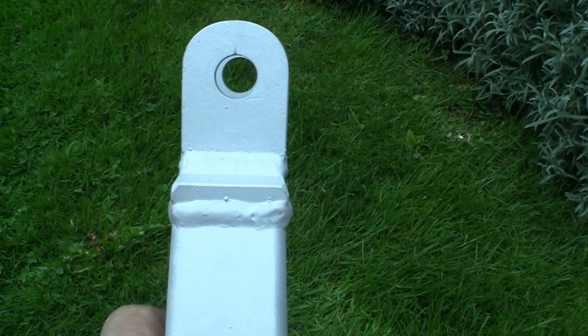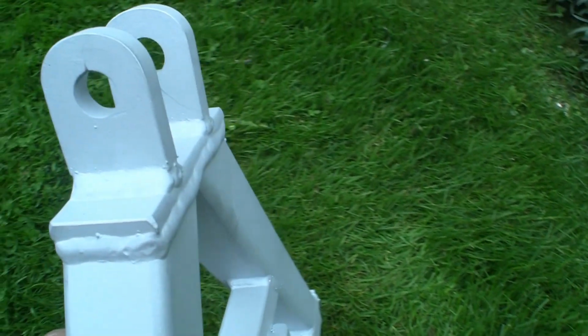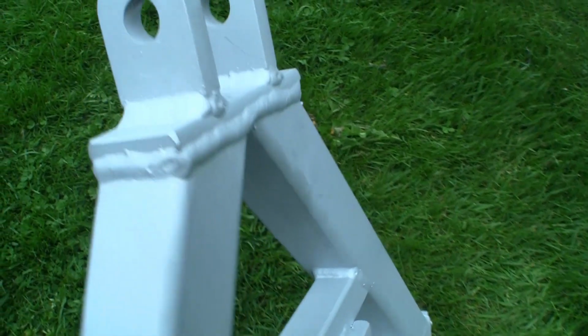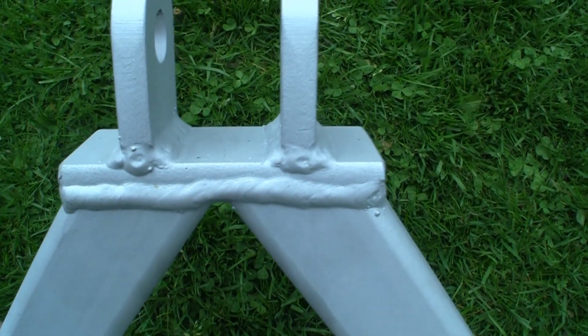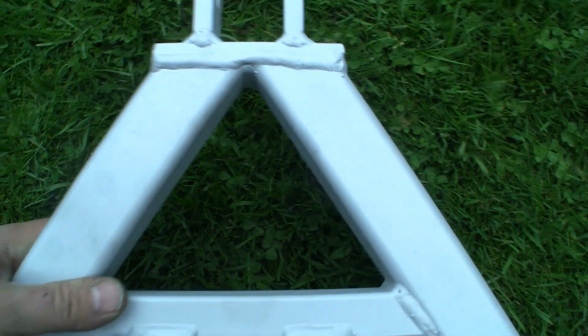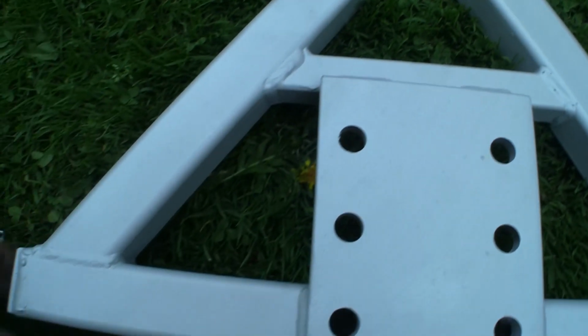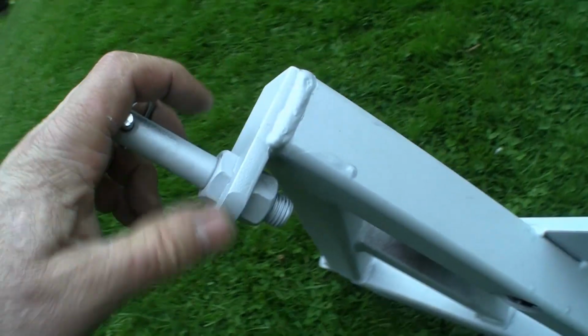It's much easier doing that than cutting the lugs first and then trying to fiddle about with a pair of grips, trying to grind them to size and drill them. Just do it in a straight length. And I welded them to another bit of 1.5 by 3/8 with the appropriate gap. And then I proceeded to make some more.